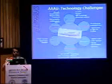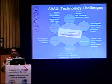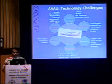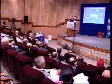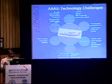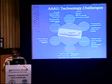Obviously, one will expect you to have a bigger, larger, and maybe squarish antenna. The other will expect you to go for a sleek, rounder, smoother, polished surface from the aerodynamics point of view. So this challenge ought to be taken care of. One is the external flow from the drag point of view. Another, equally important, is the internal flow. Because the part of the air which is going inside, if it is not diverted inside properly without much drag, you will not be able to cool the system, because all the electronics is freely getting cooled as and when the aircraft is flying. That's the ram air cooling. So a good amount of airflow needs to be studied for both external as well as internal.